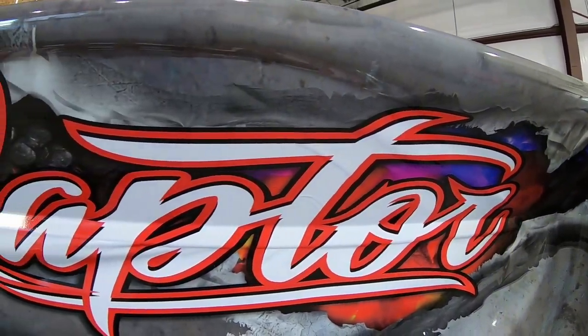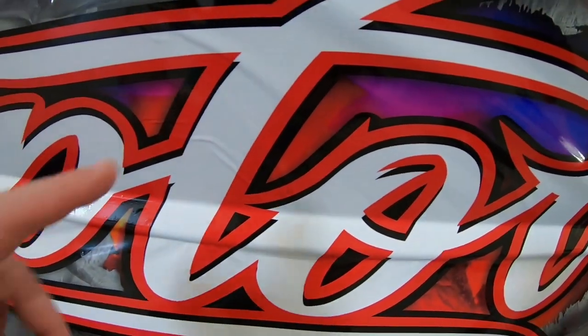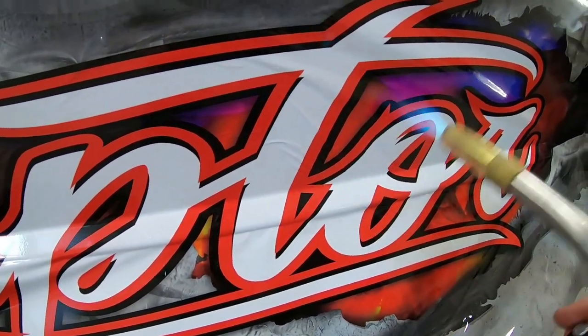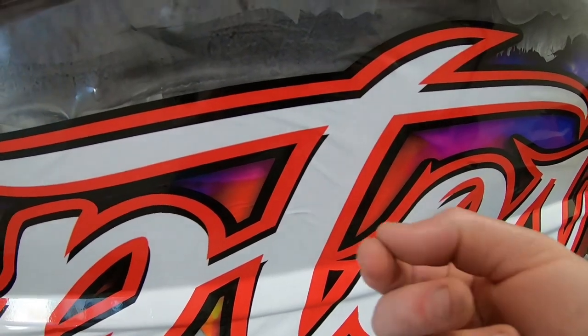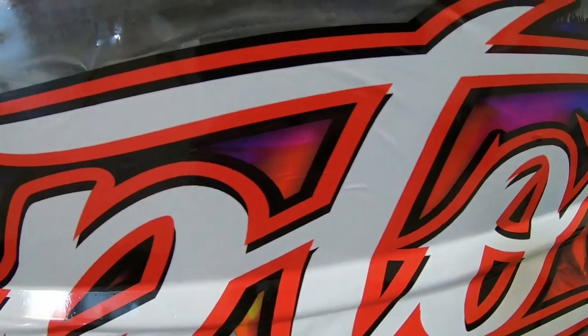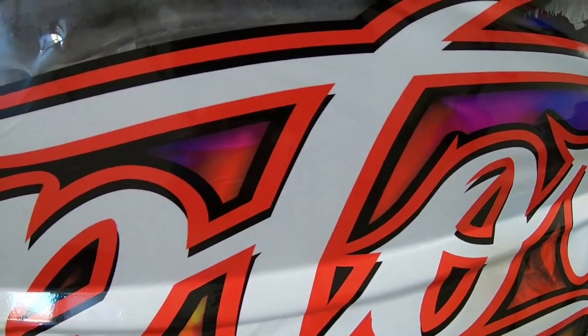Got this whole complete ridge pretty much wrapped in nice and solid. There are a couple light wrinkles in here — don't freak out if you get some of those. Just a little kick of your torch will flatten these right out. You just want to kind of move it a little fast. You can kind of see them wiggling a little bit, and after a few seconds those will flatten up and then you can come back over them with your squeegee and get them pushed out. If you get a solid wrinkle with the adhesive making contact — basically like a pinch — then you're pretty much going to have to pull that out. But these little light wrinkles you can just warm those up and they'll essentially just shrink themselves out.